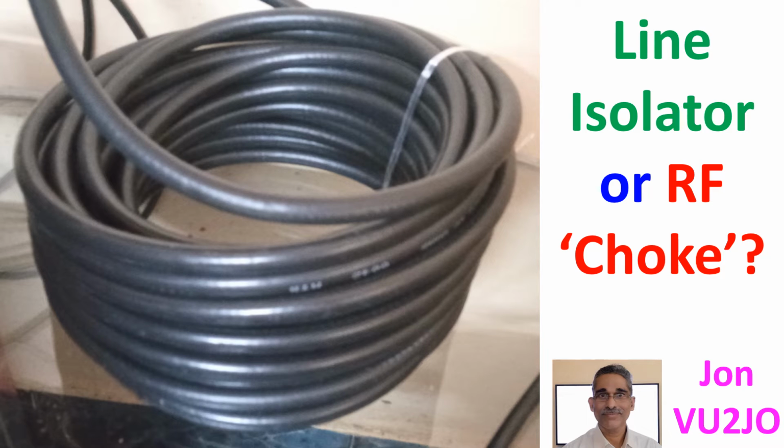A few days back, I had built an inverted V dipole antenna for 40 meter and mounted it in a zig-zag fashion due to dearth of space in my compound. I tried two different orientations and could not get a satisfactory result while checking into the local HF nets. The net controller was getting my signals very weak, though I was using up to 35 watt on LSB. At the same time, I was able to hear the net controller and most other stations loud and clear.